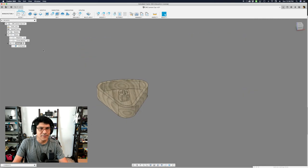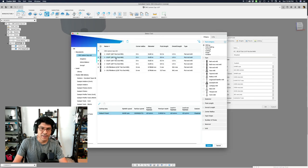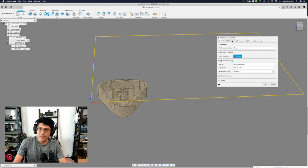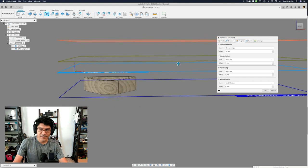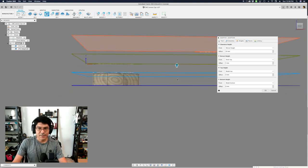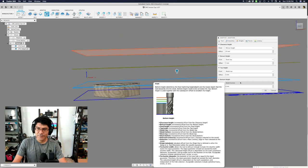I'll hit close. Next, I'm going to apply a 3D adaptive. I'll click 3D adaptive — by default the 1/8 inch tool from the last selection is already selected, so I can just verify and hit OK. Under geometry, I'm not selecting anything yet. For heights, I need to change the top height — the top of our cut is now the model, not the stock, since we've already faced our material. So I'm telling the adaptive clearing to start right at the top of the model. The bottom height is still the bottom of our model, so that's set up fine.